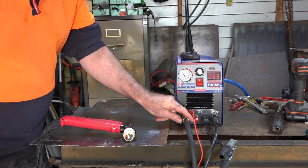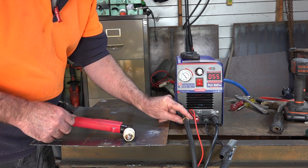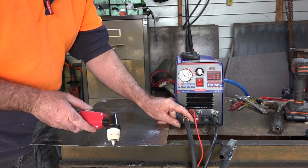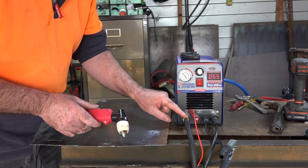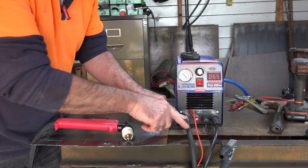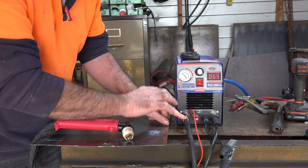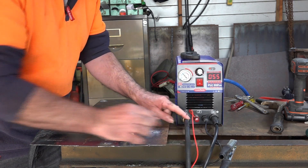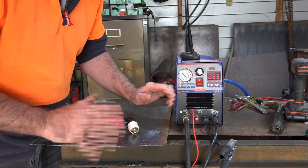So I checked all my leads and this one here was loose. Another tip for you guys: don't hold on to this lead if it hasn't got a plastic cover on it and push the button on your torch at the same time, because you'll electrocute yourself. I got a little bit of a tingle before when I did it. A lot of these plasma cutters have a plastic cover because this is not only the air lead — this is the main power lead for your torch. It's got a wire running all the way up the guts here, and the air goes around the outside and makes your plasma come out of the torch, but it also cools off the wire inside this lead. Don't hold on to this and push this at the same time because you might get a nasty surprise.